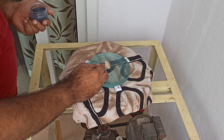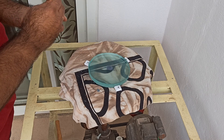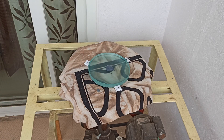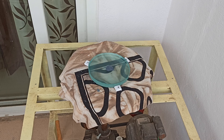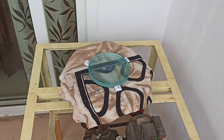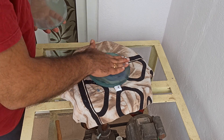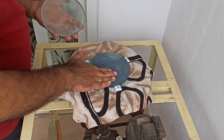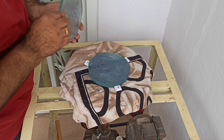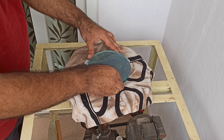I'm applying the 600-grade silicon carbide onto the surface of the mirror — a little bit is enough, there are probably two large drops over there. It's like a slurry. After applying the paste I smear it around the surface nicely, and whatever is left on my finger I just tap it onto the surface of the tool and smear it around once more.